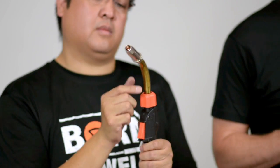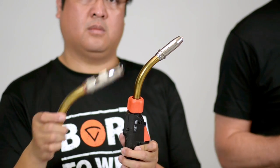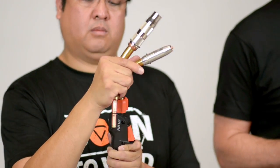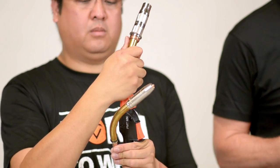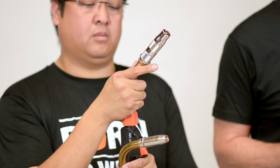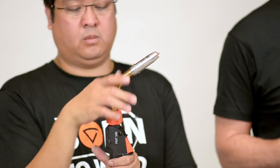The PMT MN range is a PMT gun specifically designed for gas-cooled root-pass welding. It includes multiple neck options. The design includes longer and tapered contact tips, making it easier for the welder to see and locate the weld pool. This delivers more accurate, quicker and more productive welding than conventional MiG guns in root-pass welding applications. PMT MN guns are a standard feature on our FastMig X-Black Twin Feed Package, specifically designed for pipe welding applications.